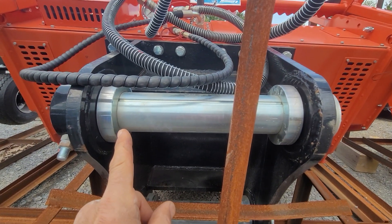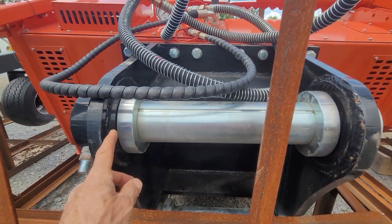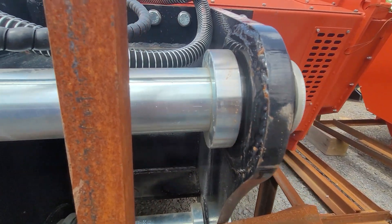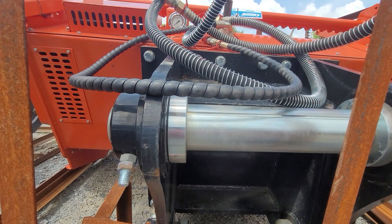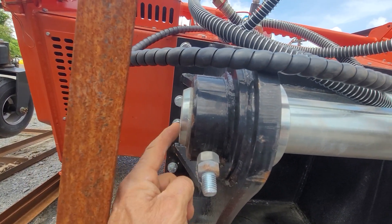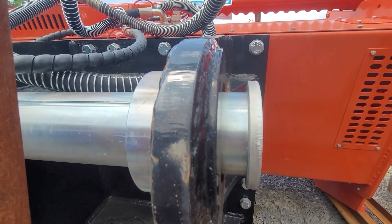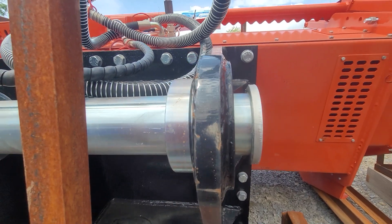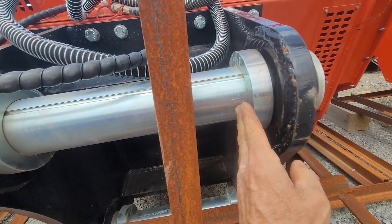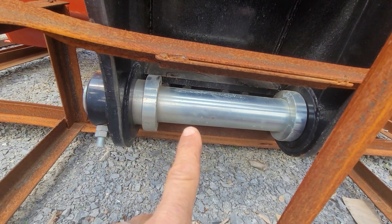From between the collars is roughly 14 inches. From the black part on one side to the other is about 16 and a quarter inches. The outside dimension from black part to black part — not including the pin — is about 22 inches. So to summarize: I've given you the pin diameter, between-ear spacing, and pin center-to-center.